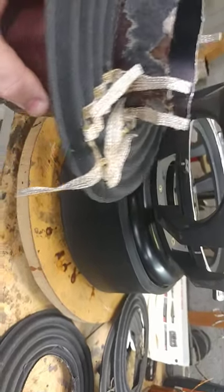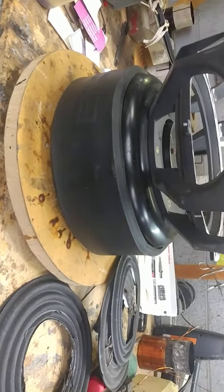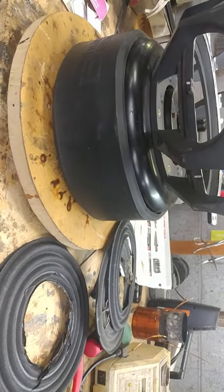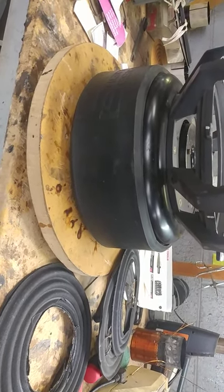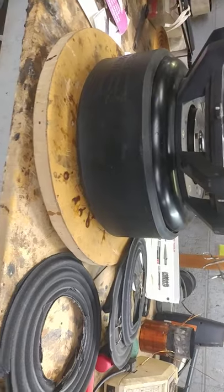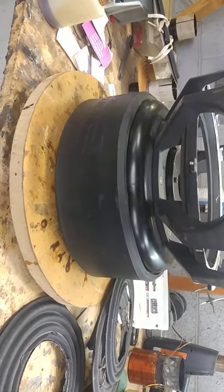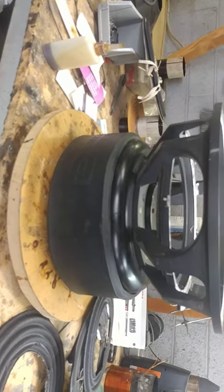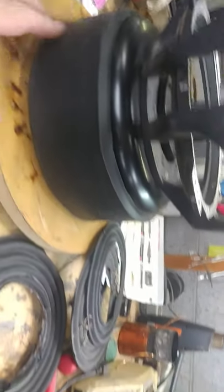All coils are rated by heat, not power, because the power is determined by the motor, the stroke, how much surface area is on the coil, and the moving mass — what kind of load you see. A woofer will handle more power as an 18 versus a 12 on the same motor. Some companies have switched, like Sundown — they use a standard conservative power rating. The SA series handles, I think, 650 or 750 watts, but people run real power of 1150 with it. It's just a conservative rating. It depends on the box, the program material, all kinds of things. I did a whole blog article on it — no matter what the rating is, it's both a lie and the truth in one way or another.